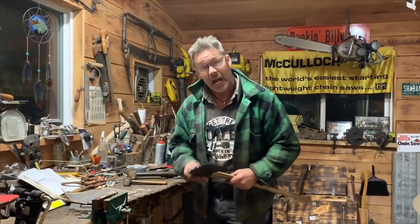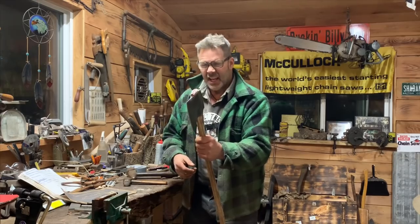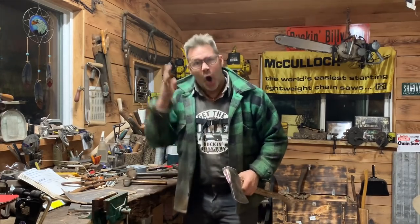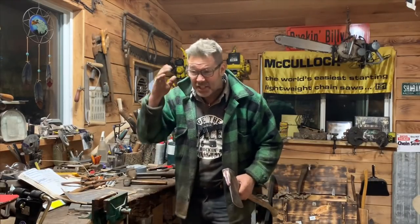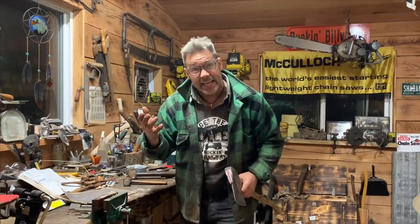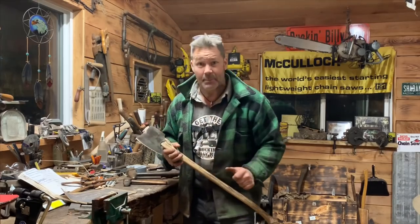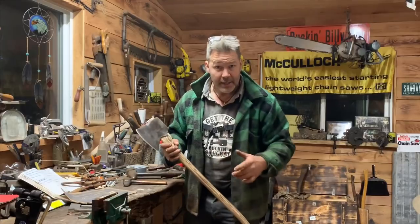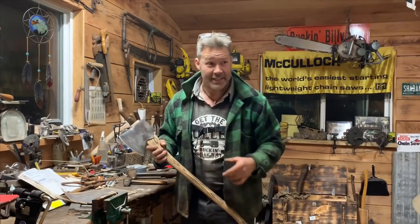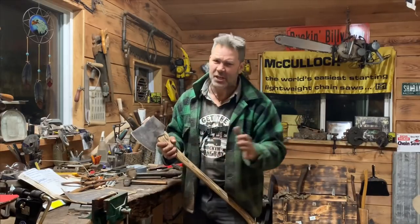I don't know what to say, except take your time. On, off, on, off, on, off, on, off. Use the small hand tools. Stay away from the sanders in the beginning when you're hafting. Just wood rasps are good in the beginning. They are, friends. The wood rasps work good in the beginning. They allow you to just take little bits. Work your way up to the spokeshave, to the draw knives. That's good. Sanders are great. I used to think sanders were cheating, but they're not. They really help finish and help get your good fit. You want a good fit.